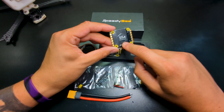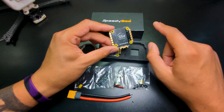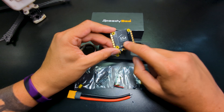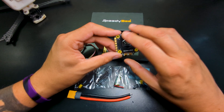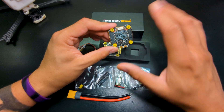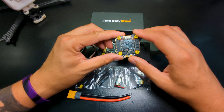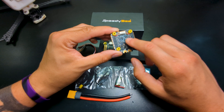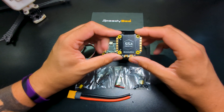Moving to the ESC, we've got a 55 amp ESC capable of up to 70 amps of burst current. That's an improvement over the previous version which was only 50 amps rated up to 55 amps of burst. I'm really digging the built-in heat sink for heat dissipation. On the back side we've got nice big MOSFETs — supposedly better quality with lower internal resistance, meaning less heat generated. They've also got more filtering capacitors than the previous version: 22 versus 16, so hopefully all that together means a much more reliable ESC.